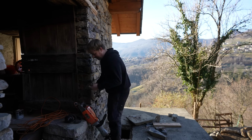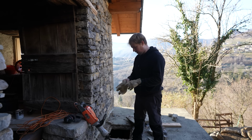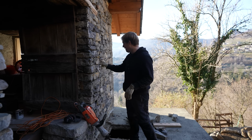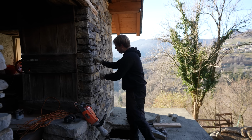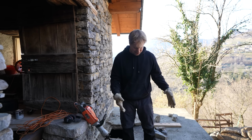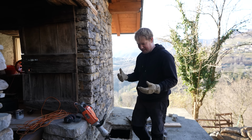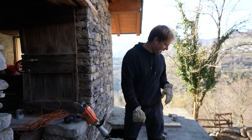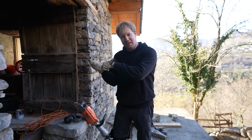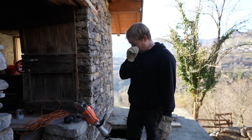All right, so the excavator was delayed a couple of hours, so I actually want to take the opportunity to slowly chip away some of the concrete from the house, because the problem we're facing is that this house is dry stacked. Remember, you can basically reach in. Here's a whole bunch of stones that are completely loose that you can pull out. And then you've got this cistern that has been cemented to those dry stack loose stones. So when the excavator comes and he starts aggressively pulling away on the cistern, my thought is that he's gonna grab a hold of that concrete, which is tied to a loose stone, and just rip it right out, causing a lot of repair work to this side of the house, or worse.